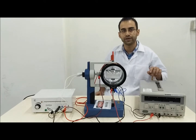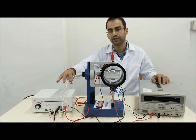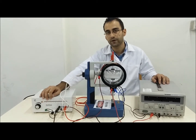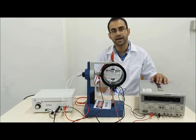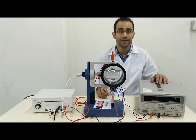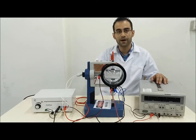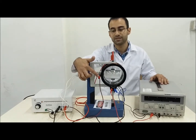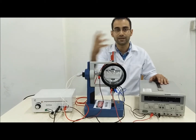I'm going to quickly cover the connections here. At the back side of the tube we have two connections which are connected to a fixed AC voltage of 6.3 volts, and this is going to power the heater inside the tube. That heater is basically the electron source — as the filament heats up it emits electrons, which stay near the heater until we accelerate them using the high voltage connections.